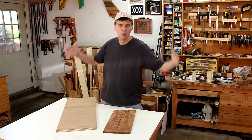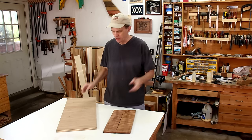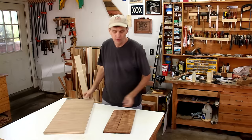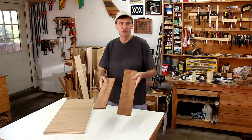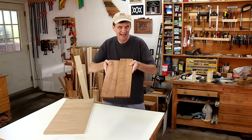If you're making a project that requires a wide board, say you're making a table top, you have two options. You can either use plywood and cut it down to whatever size you need, or you can use solid lumber, which means you're going to have to take individual strips of wood and join them together on their edges.